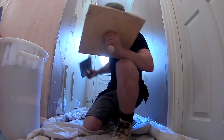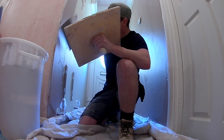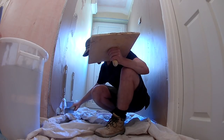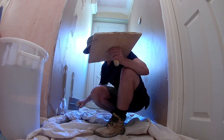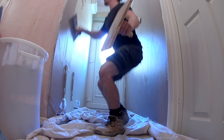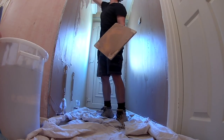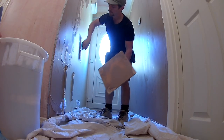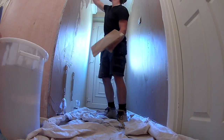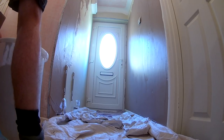As you can see I've got a tricky area here around the radiator pipes. What I've done is plastered to the corner bead and plastered onto it directly on the first coat — that's the way I've always been taught and the way I recommend. Plaster it to thickness at the beginning and then with your second coat level it off to the wall. That way you're not trying to catch up later on. You've got the plaster on, you've got it on the beads, and it's good to go. I think that's how all the best plasterers I've worked with do it.